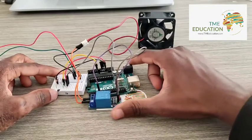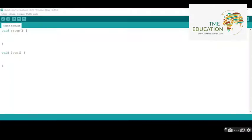Now let's type our program. I'm going to use #define and define the variable 'fan' — that's our 12-volt DC fan — assigned to pin 5 of the Arduino Uno. I'll also define the analog pin A0. Inside void setup, I'm going to type Serial.begin at 9600 for communication.